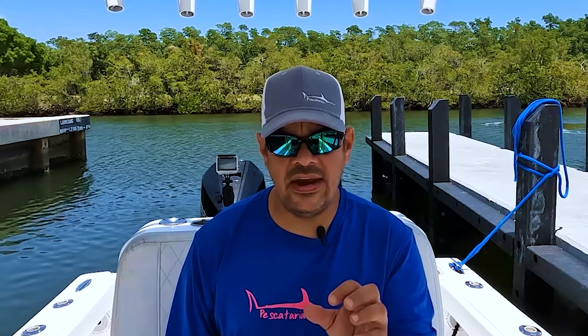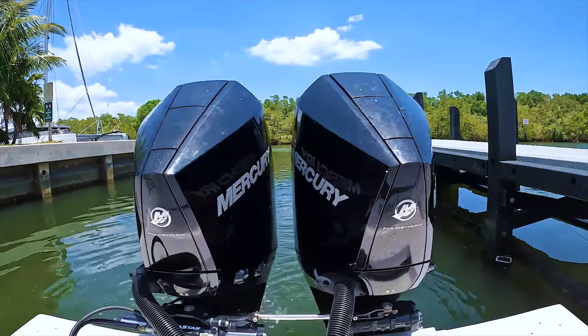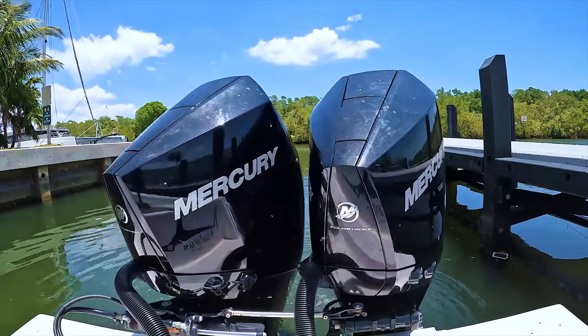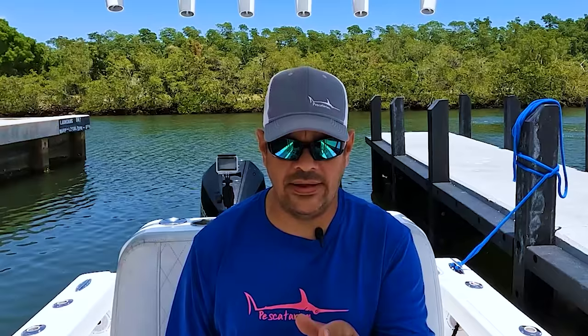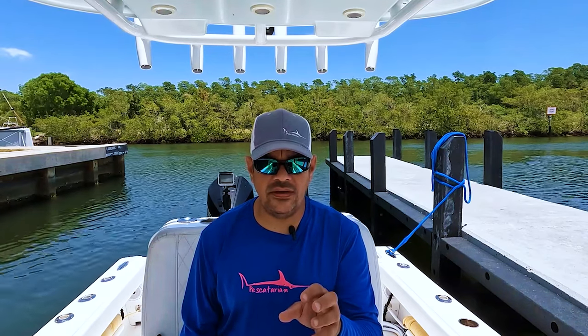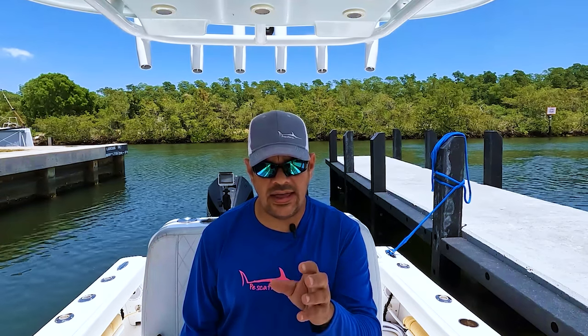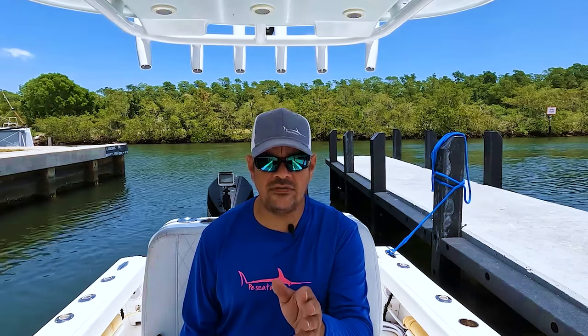This is a basic test. Once everything is connected, you take your keys and you move your rudder left and right. What this does is it tells you that the ECU controller is communicating with the autopilot pump correctly. Now, before you can use your autopilot, you have to complete the Sea Trial Wizard setup and calibration, because that calibrates your heading sensor to your specific boat.